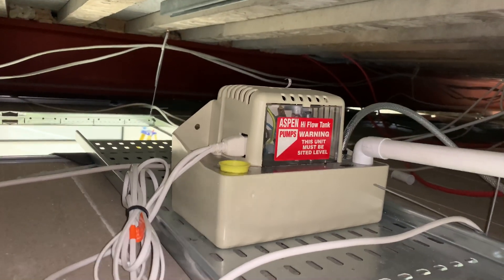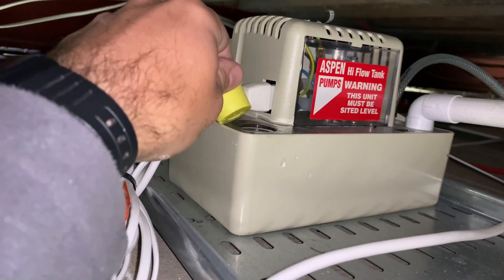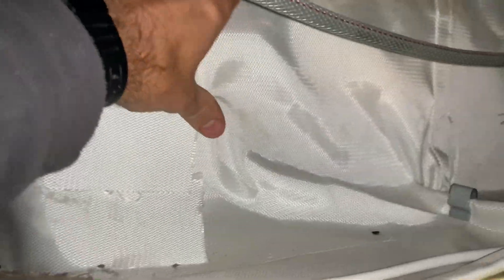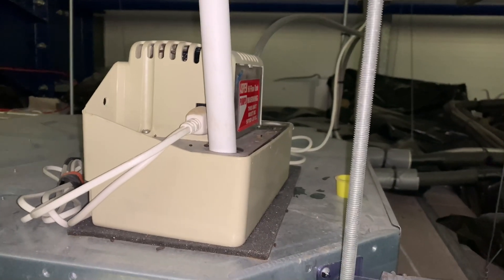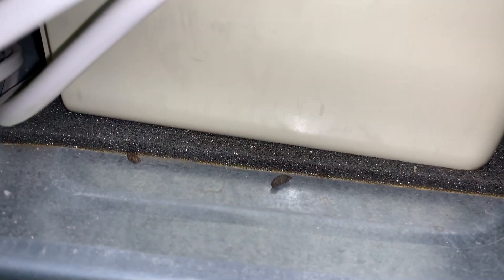More interestingly, I've never quite seen it done like this before - they've cut a piece of cable tray to span the ceiling grid and then popped the pump on top. I'll test all these pumps and check their condition. The units downstairs also have a fire hood over them, which you don't see often. And it looks like we've had some furry friends running around on this one - definitely signs of rodents, so keep an eye out to make sure they haven't gnawed through any cables.